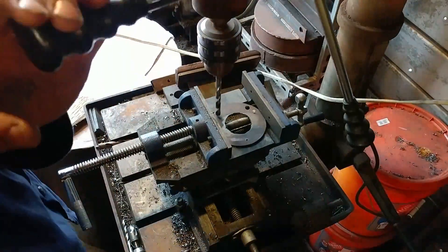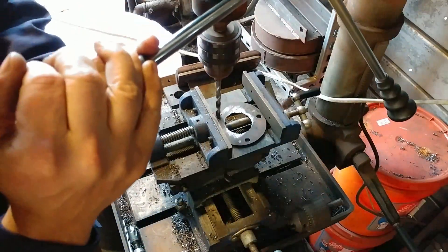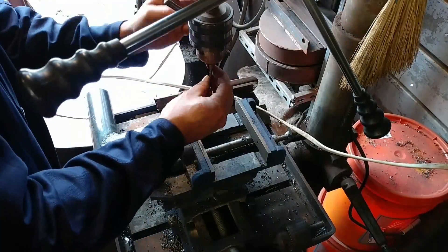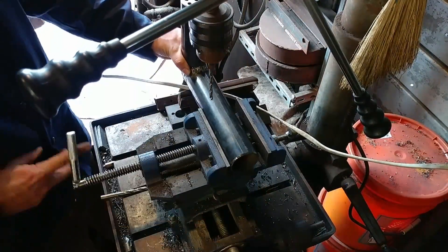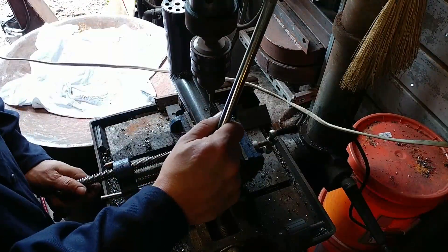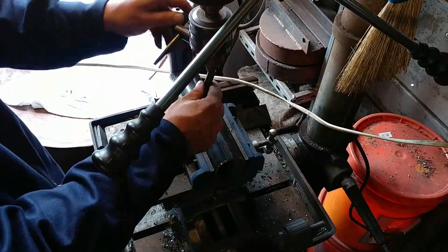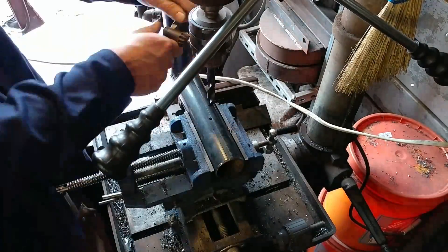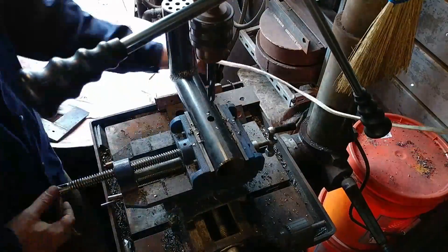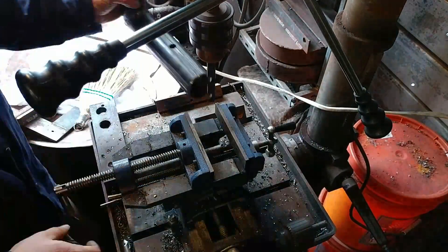I'm drilling three 1/8-inch holes in our flange plate — that will be the next process. As you can see, we've already put our distribution plate in there for our flame — our burner, our cheese grate — and then we've got our flange plate welded up. In this part I am essentially drilling a pilot hole, and then drilling the hole for the gas pipe itself.